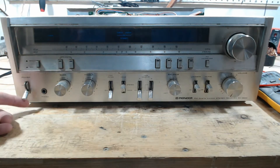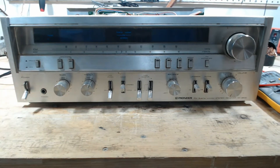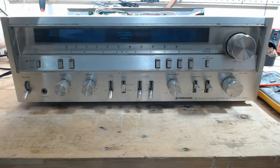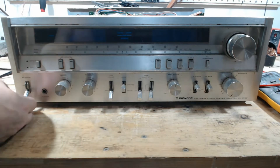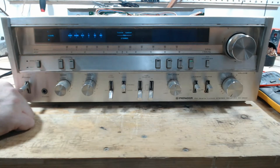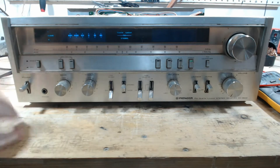It's got a brightly glowing bulb on the dim bulb tester — the bulb is probably too small. Switched it out. Much better — there's a relay click. 75-watt bulb in here; this is a 60 to 65-watt receiver.